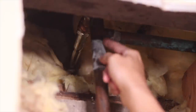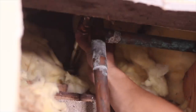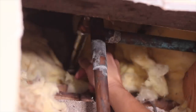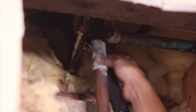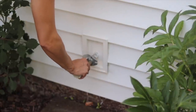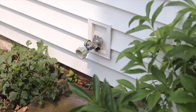Here we can see my water line coming up, and back here you can see the attachment for the exterior faucet. The system I'm going to install already has a female end on it, so all I have to do is use a crescent wrench to unscrew this piece. It's going to be a little tight in here. With the caulking removed on the outside, the existing faucet is loose and I can wiggle it slightly. You'll see a clip of what it looked like turning that crescent wrench — from the inside the faucet is twisting in a circle.